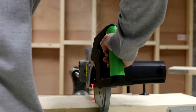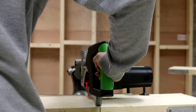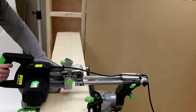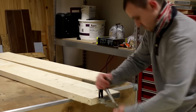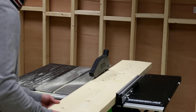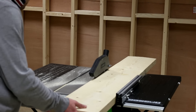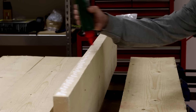I'm going to start with the scaffold boards. I want a length of 1.3m for the top, so I cut the boards with the new Evolution Fury 3S mitre saw. Two boards were more than enough for the top — I decided to make the top four boards wide. I removed the metal ends to the boards and cleaned up the edges on the table saw, cutting a very thin strip off both sides to give the wood glue a smoother surface to adhere to.